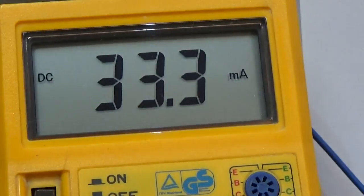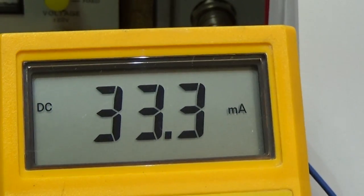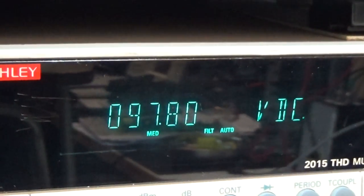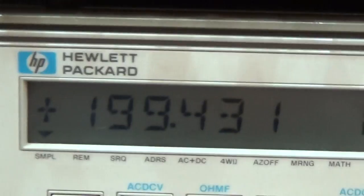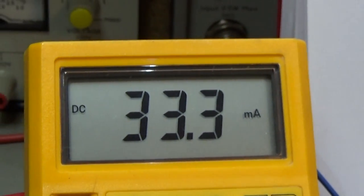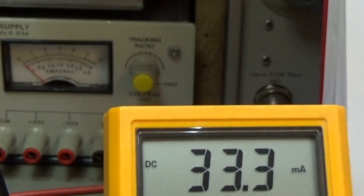Okay, so now let's turn down our G1, our gate voltage, to zero. And I will show our main current through the tube down here. And now you see that current starts to fly. And now we have zero volt G1, and what we can read down here is that we have 33.3 milliamps through our tube.